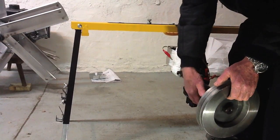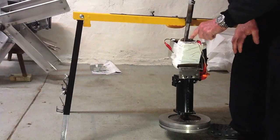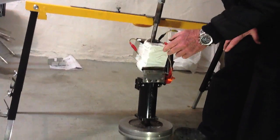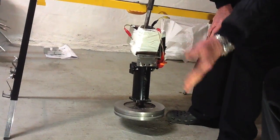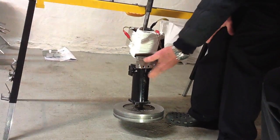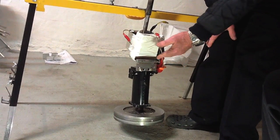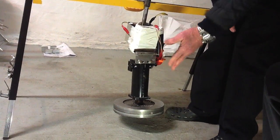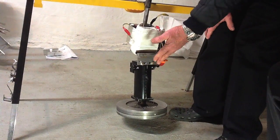This motor is rated at 12 volts, which is all we're going to use — we have a 12 volt battery. We could put 24, but we're only going to use 12. To raise this 280 inch-pounds with a motor that can only do 6.38 inch-pounds, and that does that using 16 amps. So we have to remember: 16 amps and 6.38 inch-pounds is what this motor puts out.